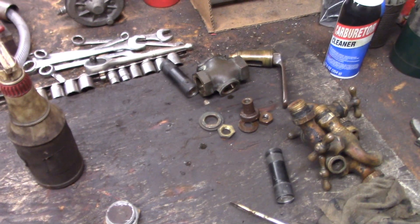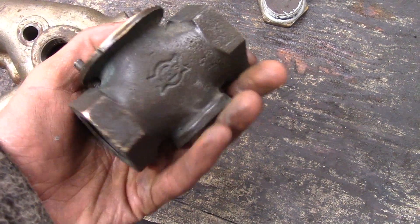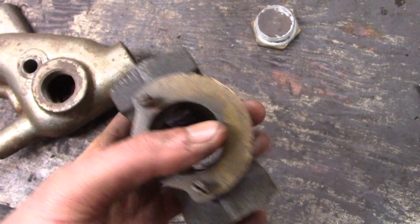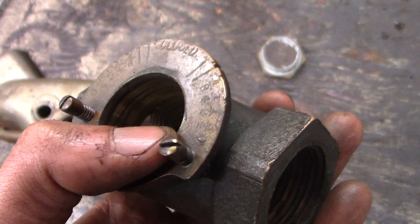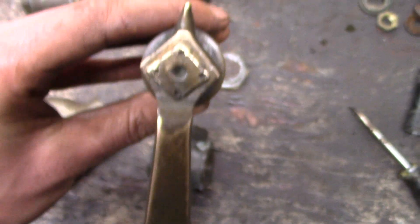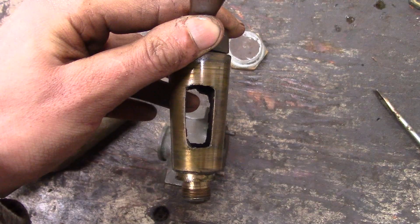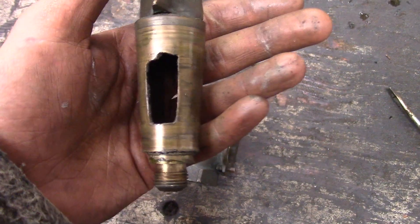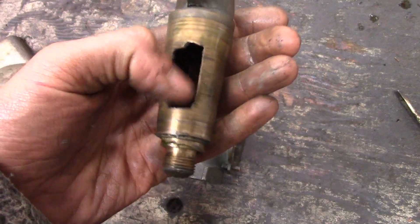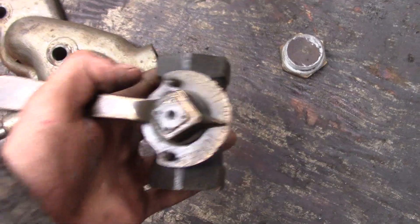The one last thing I'm going to mention, since I have it apart, is here's the diamond valve that came with the engine. This is something to keep in mind if you're buying a diamond valve for an engine of yours. This is a body with a graduated face — half, quarter, eighth open — and here's the handle; this is all original as far as I can tell, the pointer and everything. But look at that — that's not a diamond valve, that's just a plug valve. It's possible this was swapped at some point. So just because you get a valve that looks like this doesn't necessarily mean you're getting a diamond valve, unfortunately.